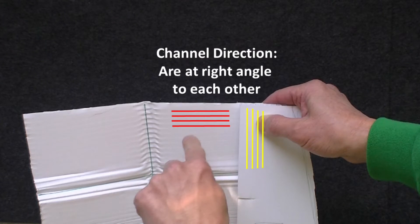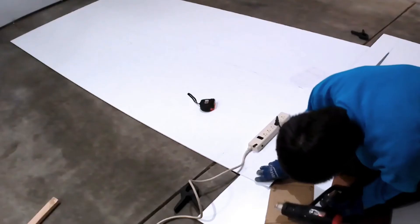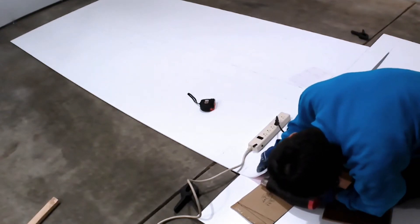The second method is the overlapping joint. First, I heat up the bottom side of the top sheet of coroplast. At the same time, I keep the top surface of the bottom coroplast warm. Then I press the two sheets together and allow the joint to cool down.